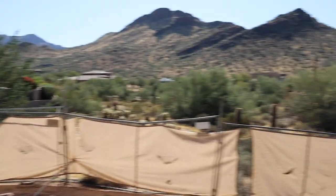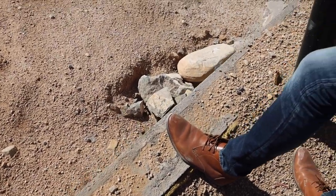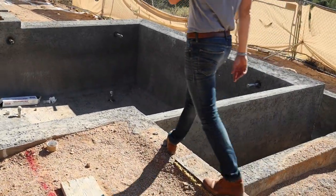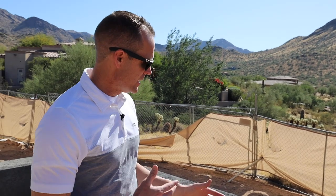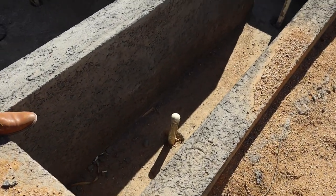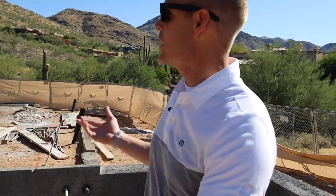The first thing that's always done is, as you see here, we come in and put these retaining walls because we do have a grade. It's not a super steep grade, but this is a canyon. For this canyon modern, we had to come in and put these retaining walls, and then we had to put in the pool — that's typically the first thing that goes in. The pool is dug, we have all the rebar installed and inspected, and we have the shotcrete put in, as you see here. This right here is our trough, and every detail of the trough — we have to run this through the HOA. The HOA has restrictions on the width, height, and depth of this trough. You can see this negative slope right here — the water level comes over this tile and drops down to give you that nice infinity edge as you're looking out to the hillside. This is the first component to go in, and then we can start working on the home structure.